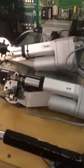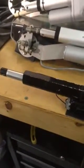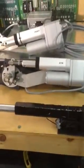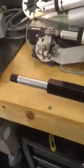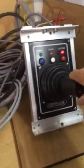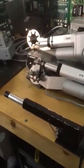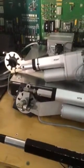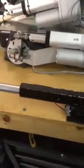In connection and in unison with this deflector system, there's also a steering mechanism in the actuator. This is just a simulation for the steering — sometimes we use an electric actuator, but most of the time these systems are tied into the hydraulic system. We steer a hydraulic pump or hydraulic valves, and this is proportional too. Wherever the joystick is being moved, that's where the actuator will go. You can actually move all three at the same time.